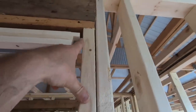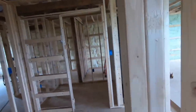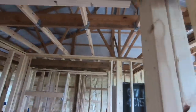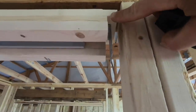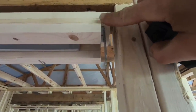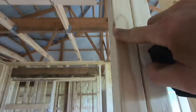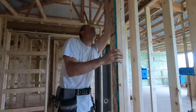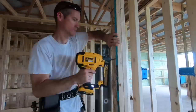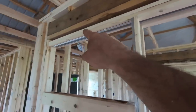What I'm going to do is take a half-inch piece of plywood and attach it to this jamb right here all the way down, because I have an inch and a quarter opening right here. So I'm going to put a half-inch piece of plywood down here, and that will leave me a three-quarter-inch space to put my finished trim on. I'll fill this gap with a half-inch piece of plywood, three and a half inches wide. Then I can slide my finish trim in at a later time and my casing will attach to that. Then we'll get this top shimmed and fastened.